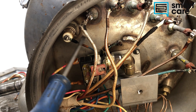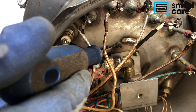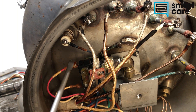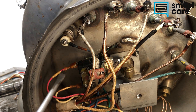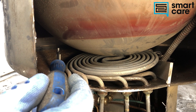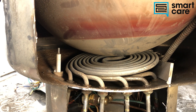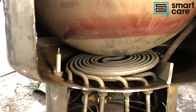Because our water level probe circuit relies on a current path to ground, we also have a ground lug over here. When we talk about ways this unit can have problems, a loose connection down here would almost certainly cause heating problems. Bad grounds could cause issues, and even buildup on the end of this probe could cause problems — scale buildup would prevent passing that current to ground. If your kettle is old enough, you may also have a mercury tilt switch mounted somewhere inside to make sure the unit is upright before it starts heating.